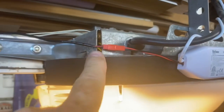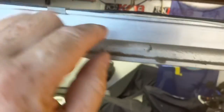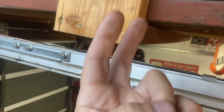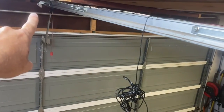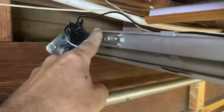Now I've got to run the sensor wire to wherever it needs to go to get one inch or less clearance when the garage door is closed. On mine, the track system has a little channel with clips where the original wires are routed, so that's what I'm using. If you don't have that, you could use little plastic staple clips with two tiny nails and staple it up onto your rafters, or zip tie it somewhere. I'm going to route it up to the front and then to the top.